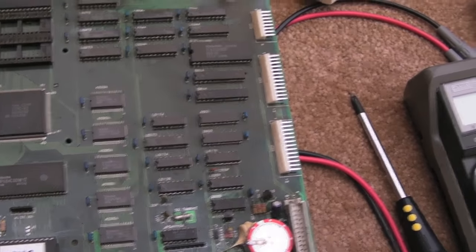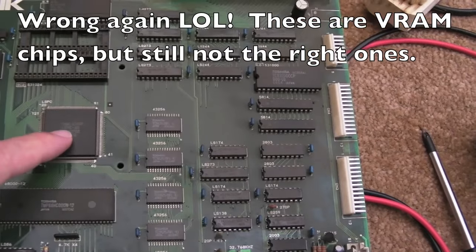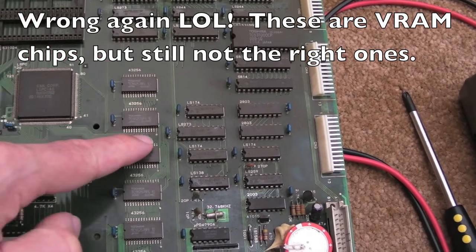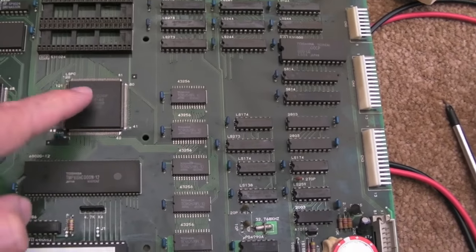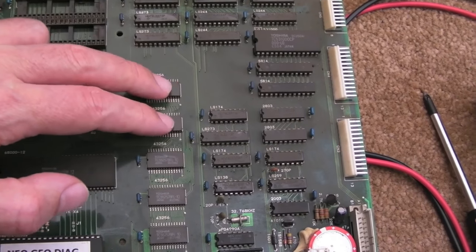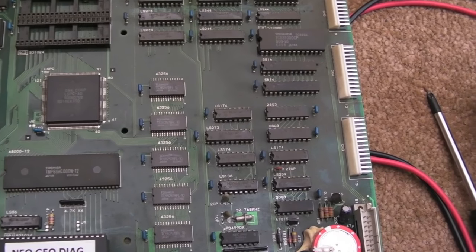I think typically some of these chip types are used for the palette on the other one - but that would seem to be the case. So I'm going to go with these two here because they're right next to the LSPC A0, which is the graphics chip. You can see the bus coming across here so I suspect these. I'm just going to get the hot air on there, remove both of these, and put a couple of new chips on there and give that a try.